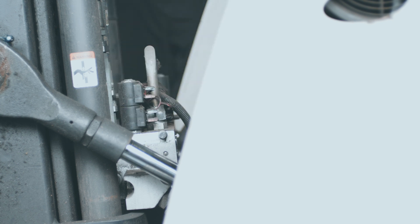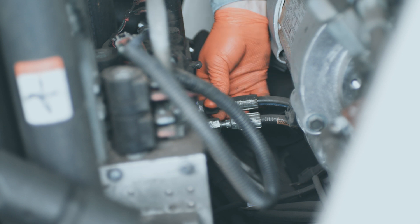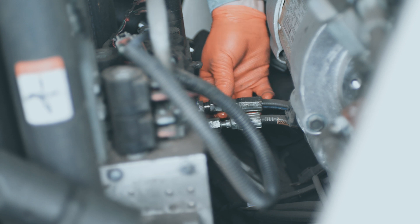After talking to the customer, since I'm already going to the trouble of getting in here and taking the mast off, I asked if I could go ahead and change both encoders and both motors so I don't have to come back next week and do the other side. So I'm just doing both motors.